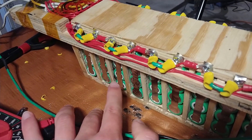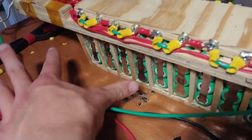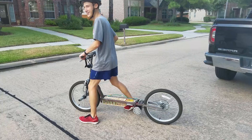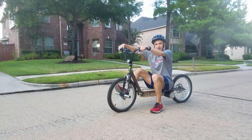Unfortunately, due to not balancing the batteries beforehand, I ran into some charging issues. While some batteries were at nominal voltage, some were completely dead. What I'm gonna do is actually cut the new batteries in half and just have this as a 13s2p configuration, just to see if the battery works. After cutting and spreading out some of the parallel groups so that each parallel group had the same voltage, it was testing time.